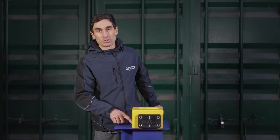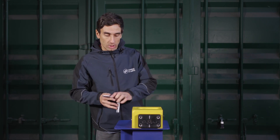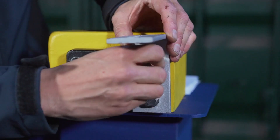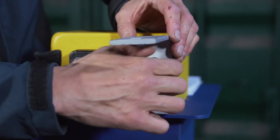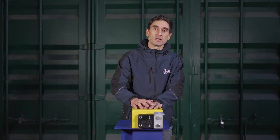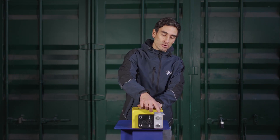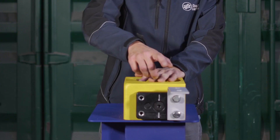It will depend a bit on whether you're using the stadium or shield holes on the top of your corner casting — with the shield hole it will sit about five millimeters lower — and it will also depend on the tolerances of the corner casting itself. Once this is bolted to the Domino Clamp, you'll be able to use these two remaining holes to attach whatever else it is that you need to finish off your container project. If you're in the States, you might want to switch over to imperial bolts — that'll be half-inch bolts for these two holes.